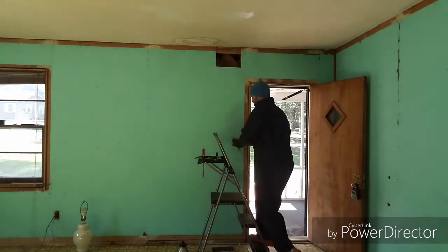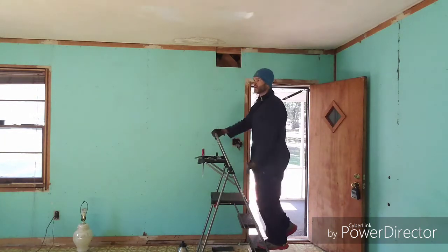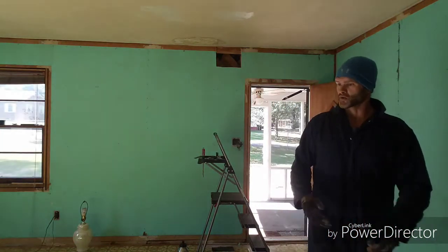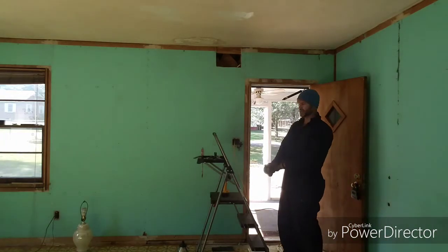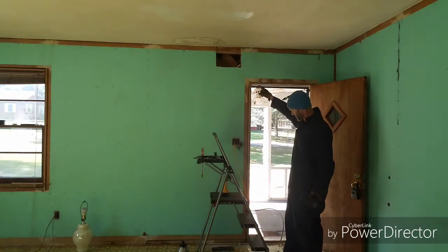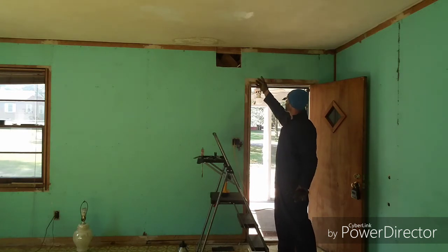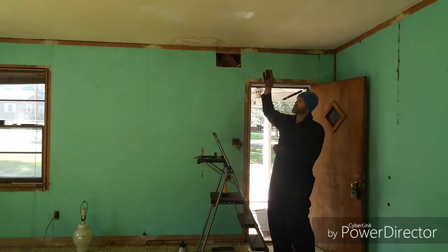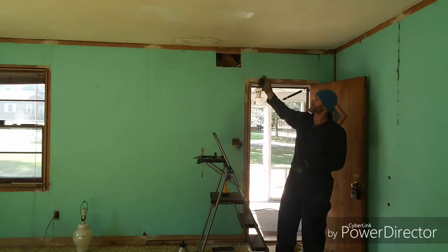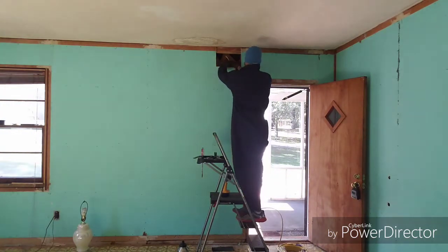Good news — there's no insulation in the walls. I'm hoping I can run my wire straight down, up and over. Got a wire coming in at the bottom and it jumped out at the top. What I need that wire to do is go back behind the top plate into the covered porch — so it won't be exposed — then back over. If I can rig it where it'll go that way as I'm pushing up, I won't have to climb all the way back in there.